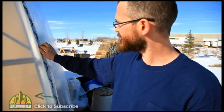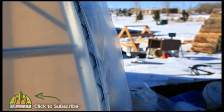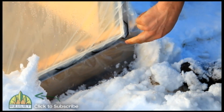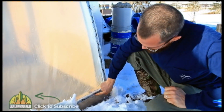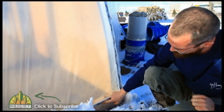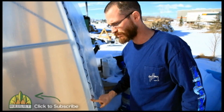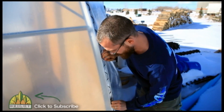Outside now — this aluminum channel here is wiggle wire channel, and we've bolted it to the frame with self-tapping screws. Down here along the baseboard we also screw it in with self-tapping screws. Because we're in a high wind-load area with sometimes 60 mile-an-hour winds, we like to screw it down about every 18 inches to make sure that channel doesn't separate and pull off. The wiggle wire itself is a spring wire that fits inside the channel. Go with the PVC-coated stuff — plain steel wire is a big mistake because it really dings up your plastic.